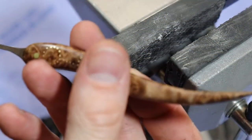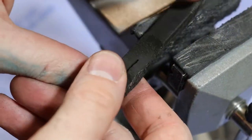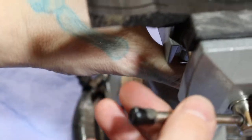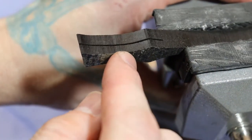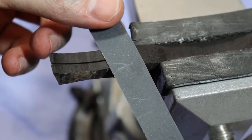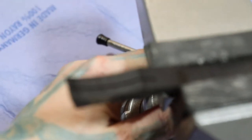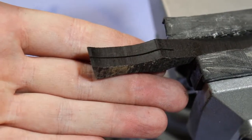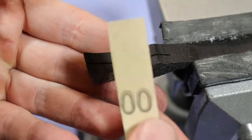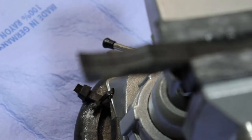You can take that as far as you'd like — I make them pretty round. For areas that are a little more detailed, like inside where the pick is going to sit, that's a smaller area. You want to use smaller strips of sandpaper so they fit right there. Otherwise these big strips go all the way across that feature. So just use smaller strips there and that'll help you get rounded sides.